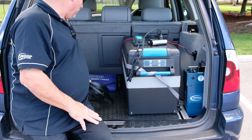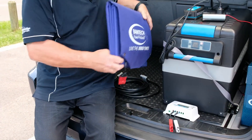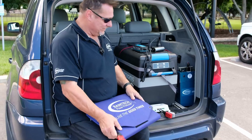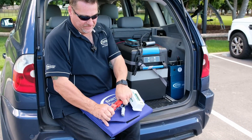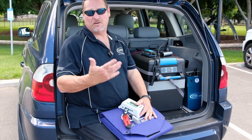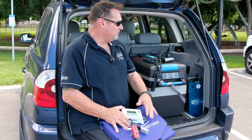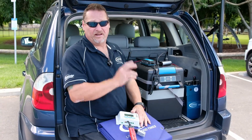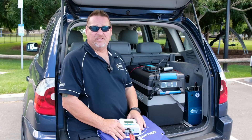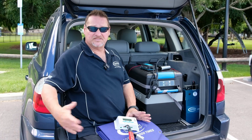If you want to stay off the grid a little bit longer, the perfect accompaniment would be to add in one of our solar blankets. We've got these in various sizes. Today I've just pulled out the blue one, which is our 120 watt solar blanket — which literally will just plug into here via the extension lead and into the unit. If you're at a campsite for an extended period of time you can throw this out into the sun. This generally puts out around 7 amps, which is similar to the charger — more than enough to keep your fridge running and your battery topped up. So you're basically off grid indefinitely for as long as you want to be. You can also change to a semi-permanent hard case fold-up panel if you prefer.